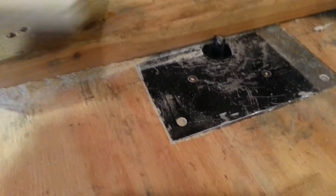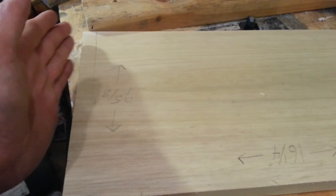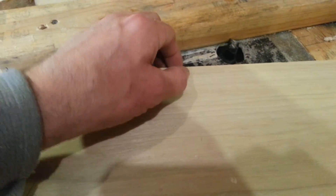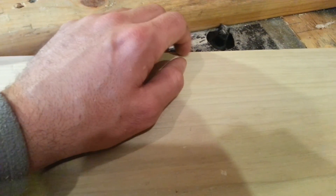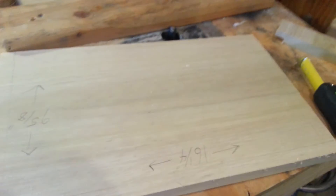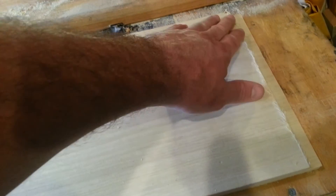The three-quarter by three-eighths rabbet will be just down the two ends of this board, and what that will allow is the side boards to sit in flush and ride that groove. We will be doing another rabbet on the tops for the frames to sit in, but we'll adjust for that. We've got all the fronts and backs ran through, we've got rabbets cut on both ends — a little sanding to take off those little pieces of waste wood and we'll be good to go on those.